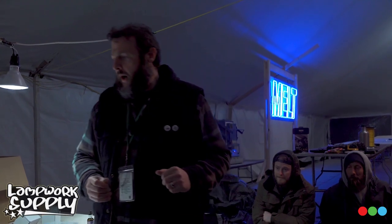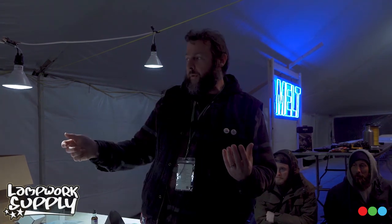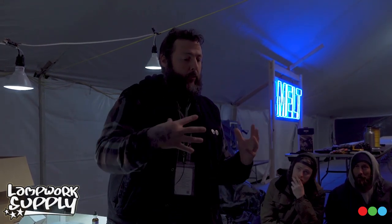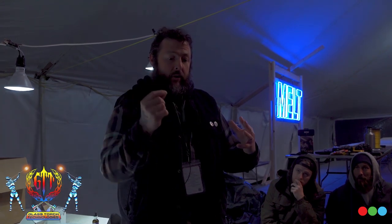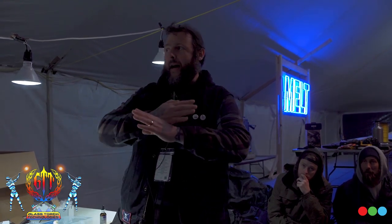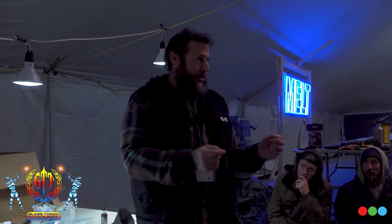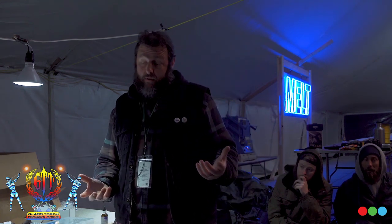I hope so. I'll also say that when I started figuring out that if I keep this point of contact right here and run a little more aggressive and it creates those little lines, I can run this side for one full day, then remove it from over here and put it over here, and then it will create striations straight for that. And what you've done is created a crosshatch pattern. It almost looks like brush strokes going across each other. So you can manipulate those surface textures in really appealing ways too, if you want.